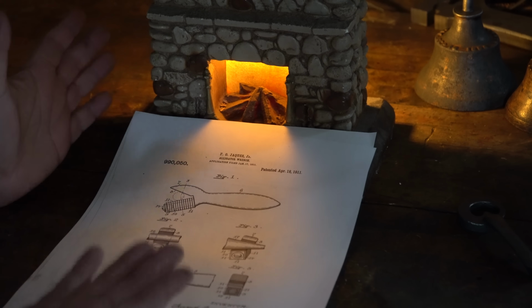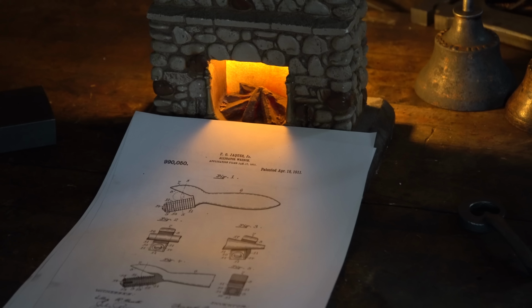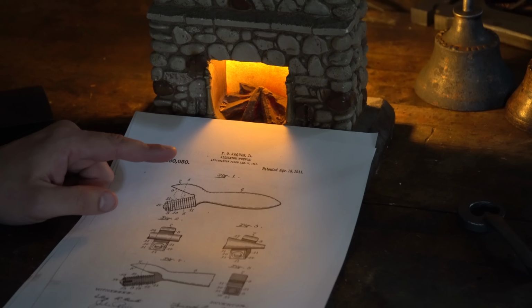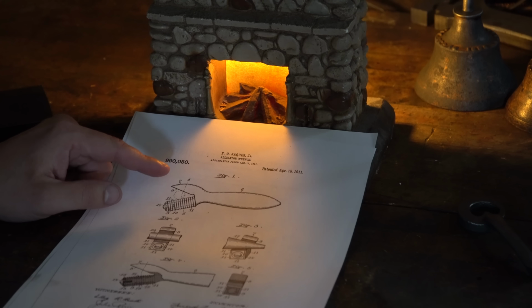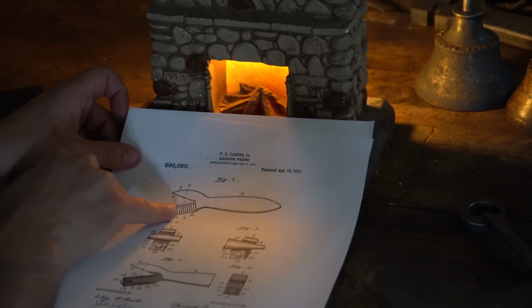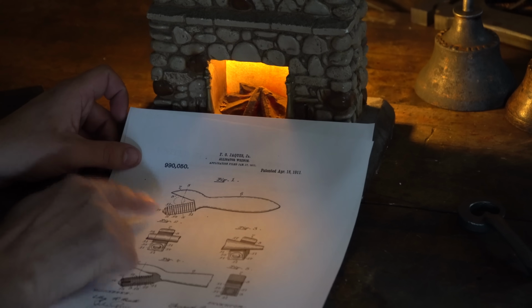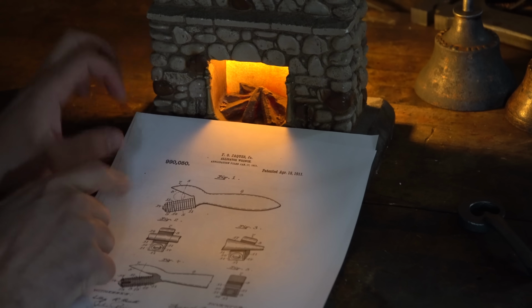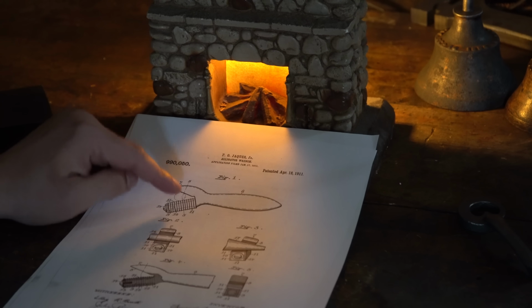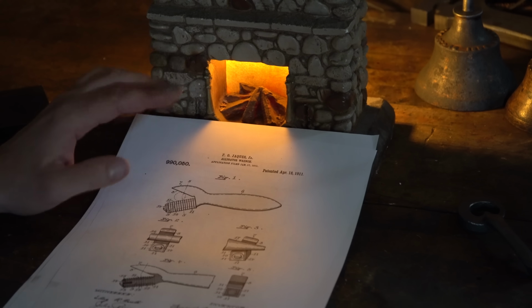But what is the most interesting, I think, is how I would get this done, or how anyone would actually put this in production. It's definitely not simple. It's a simple design, but I think it's difficult in execution. So my plan is to create this cylindrical rod that the jaw rotates around separately and thread it into the main body of the wrench, and then either weld it or not weld it, and see how that performs.